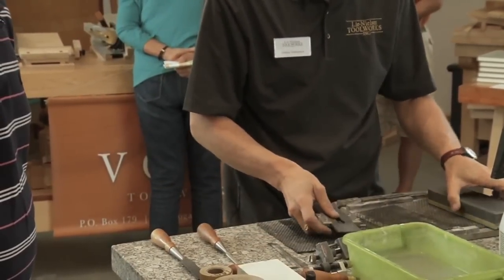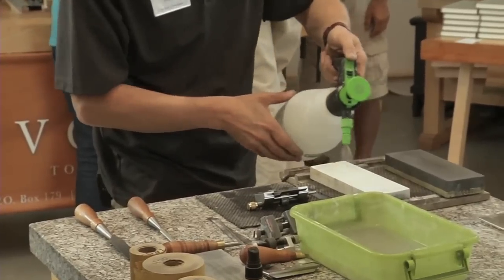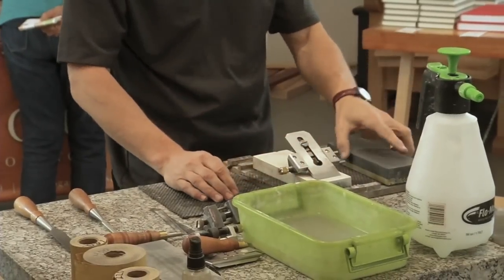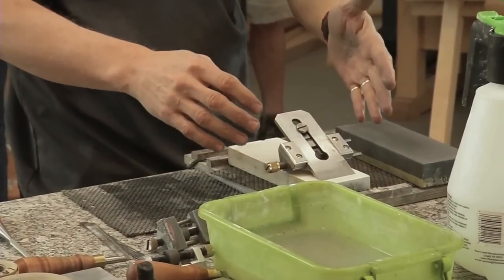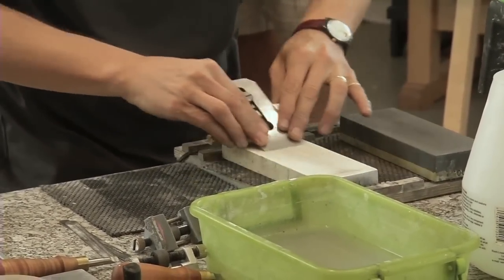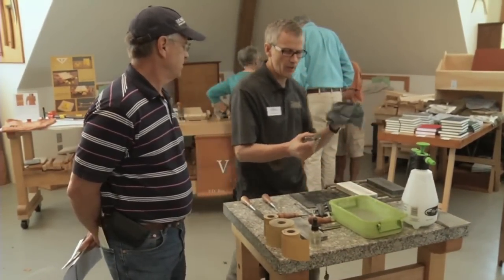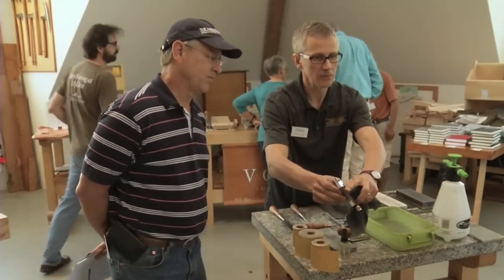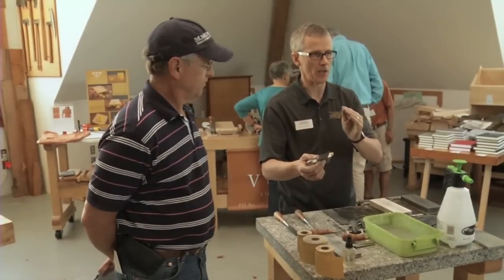Now we go from the coarse stone to the fine stone — from 1000 grit to 10,000 grit. Put a bit of water on the stone for lubrication, wheel down first. As a rule of thumb, if it took four or five strokes to get a burr on the coarse stone, use roughly double the number of strokes to polish that surface on the fine stone. A few extra strokes, then stop, wipe the water off, and verify that the micro bevel is now like a mirror. Now you have the first half of a keen, sharp edge — one polished plane.